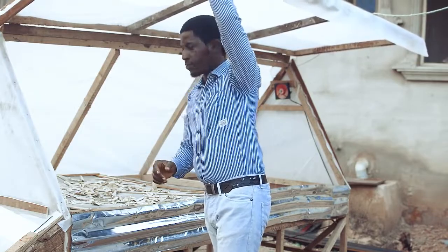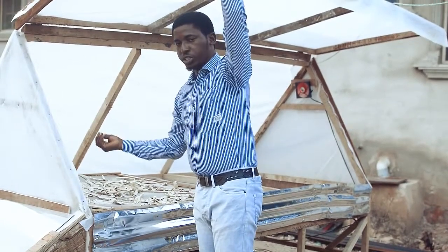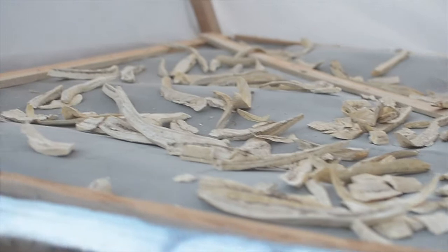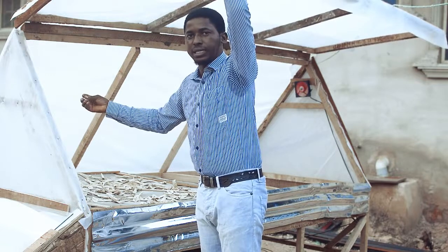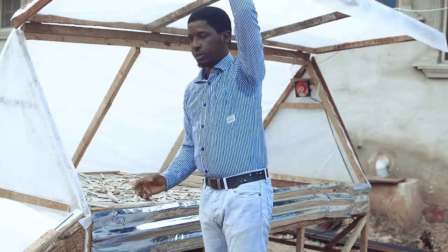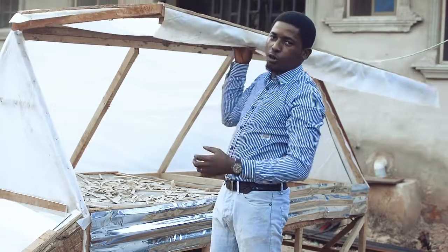Secondly, you have airflow. That is why we have fans here. I have three fans blowing, taking air from the solar collector into the drying chamber. And I also have another fan here for removing the moist air out of the dryer. When heat reaches the material, the moisture inside tends to evaporate and makes the air inside the dryer humid. The fan then takes away this moist air. As this continues — the evaporation from the food material and the air being taken away — you will soon have a wonderful result of a dried material.